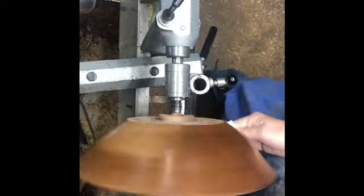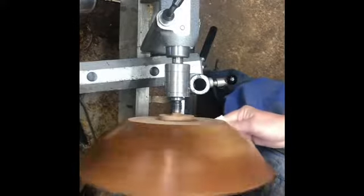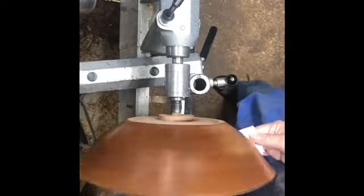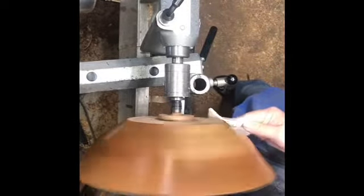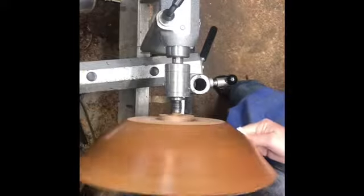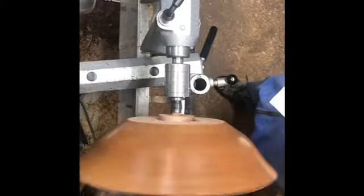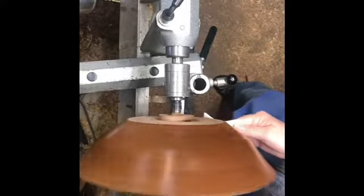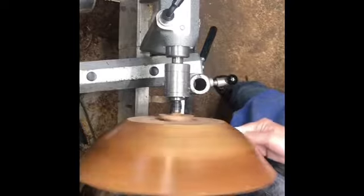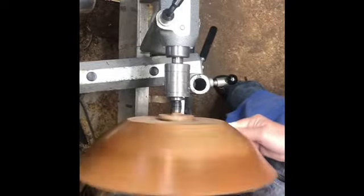I started to tell you, the shellac is the finish. The oil is a carrier. It helps carry the shellac so it can spread. If you were trying to do this with straight shellac, it would probably streak on you because it dries so quickly. And then the alcohol that you use, the alcohol will thin both the boiled linseed oil and the shellac. And so the three together, the alcohol, it's an interesting thing. By thinning the shellac, you actually cause the shellac to dry faster.